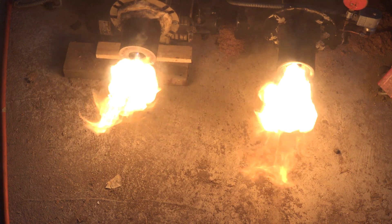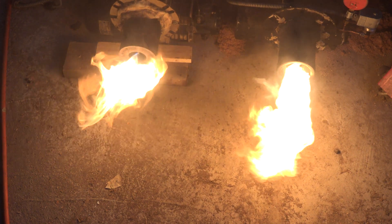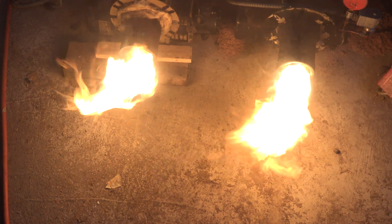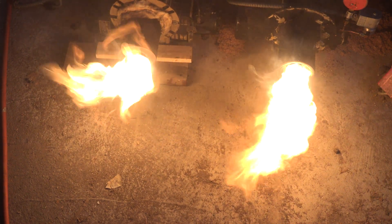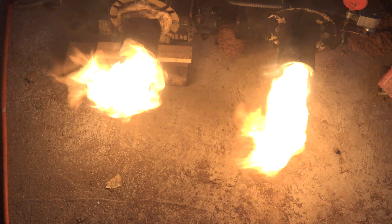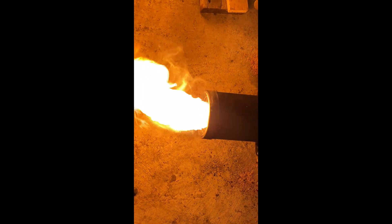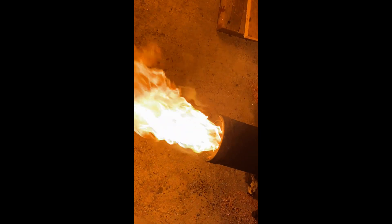The differences are fairly obvious. If you look at the conventional burner on the left, you can see the flame does not come quite back to the head — there's some distance there. If you look at the flame retention head burner, it's holding the flame on the burner head, it's much closer. Here's a close-up: you can see the flame is coming right off that head, kind of sucked right up close to it.